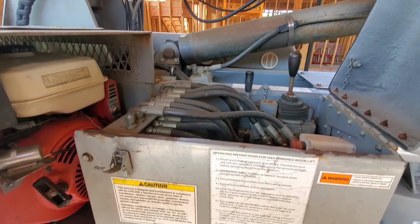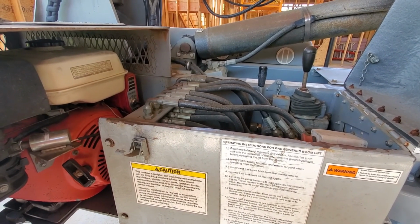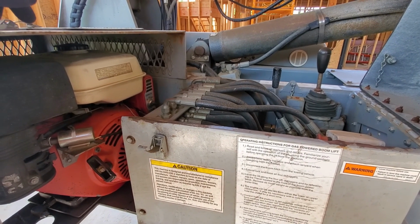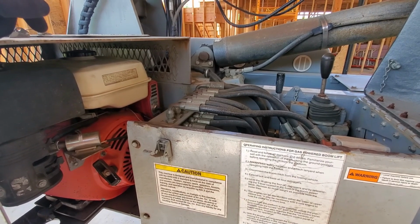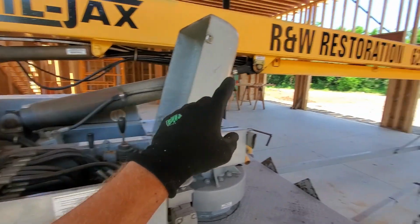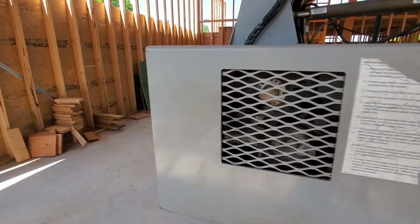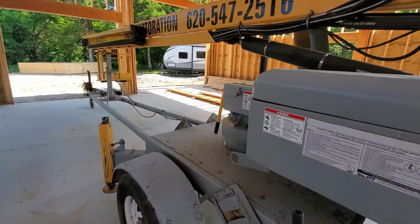So what I've done is I've ordered a new motor, an electric one with a 6-port 2-way valves. So for the 6, I've got one that rotates, one that lifts, and then the one that extends the bucket out. And then I really need another one that controls the bucket level. I'll have to figure that out when it gets here.